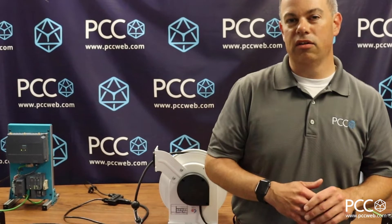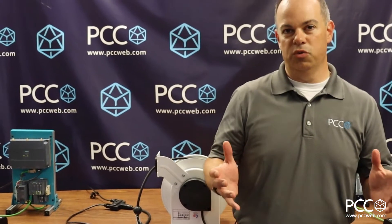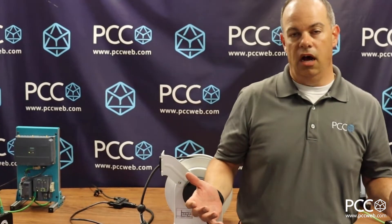If you think about distributed IO applications that involve wireless communications — situations where you have trouble running an Ethernet cable — you run a wireless application with an access point and a client. Sometimes you can run into communications issues with the environment or obstructions. So wireless has its own set of complexities. What I want to show you today is an alternative method to doing IO communications, leveraging slip rings and power rails to carry Ethernet and, in our case, PROFINET communications.